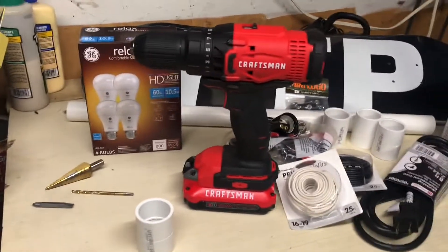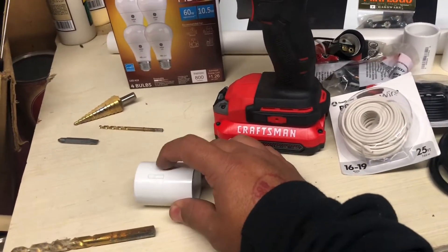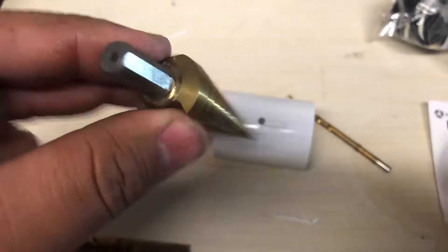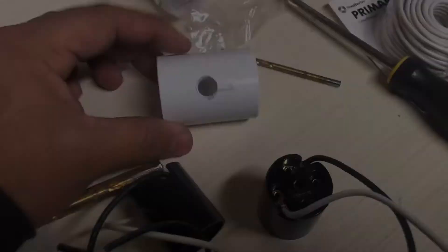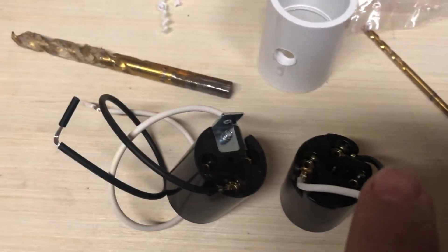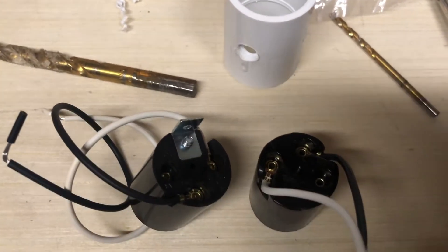This video is brought to you by 559 Tools — I use them, but they ain't paying me for it. Not yet. First thing I'm gonna do is drill a hole in this PVC coupler. Drilled my hole, now I'm gonna use this step bit to step it up. Got a hole drilled out three-eighths to get the wire in. I also took off this bracket — that's for the ground — so I'm gonna take them off of both.